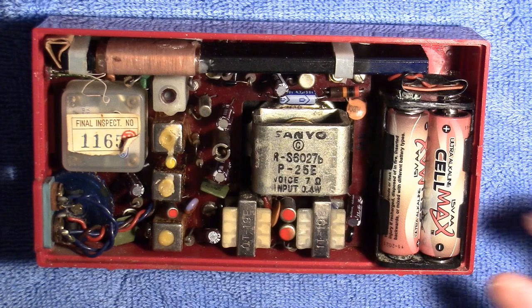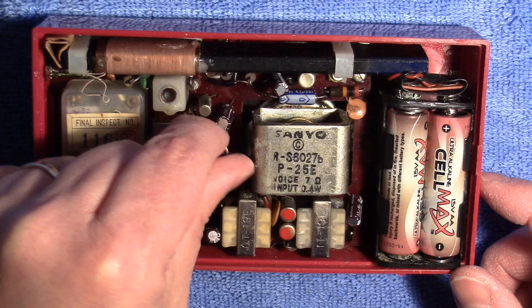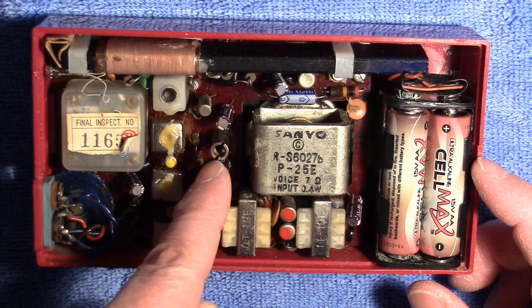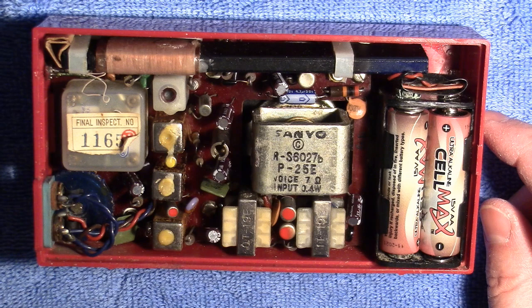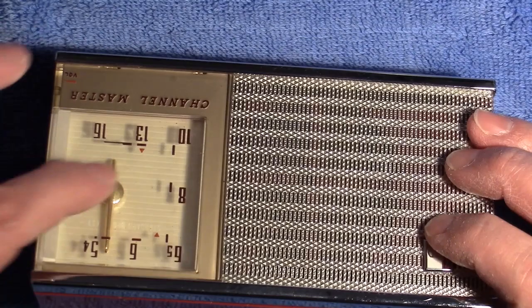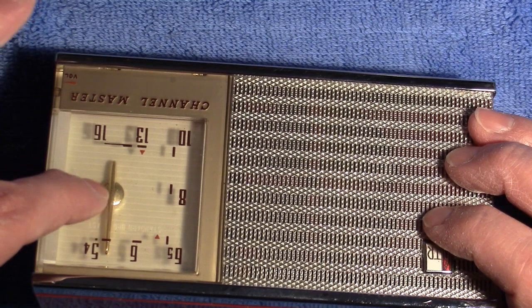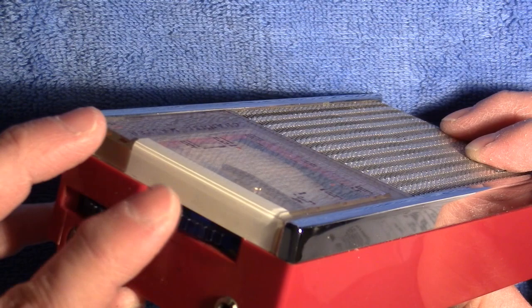It's kind of interesting how you take it apart. There's this spot here where the back of the case has a screw with a little slot — you get it started with a screwdriver and take it off. That's one of the screws that holds it in place. Then there are a couple of other shiny stainless steel colored screws — not brass — you don't have to mess with those. And then you've got to take the plastic piece that fits over the tuning wheel and pop that off the little needle as well, and then take off the actual tuning wheel — there's a nut that holds that in place — so you can get to the back of the circuit board where all the capacitors are.